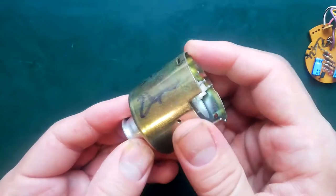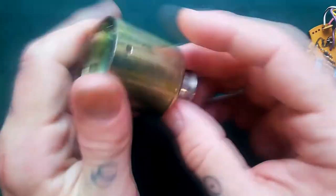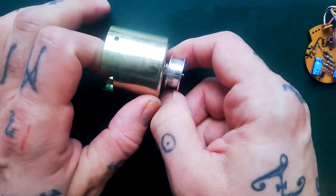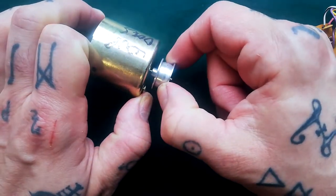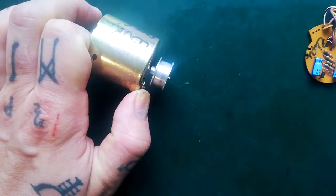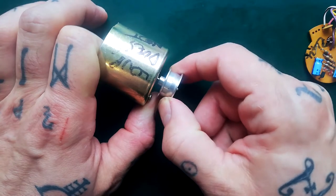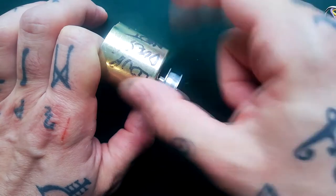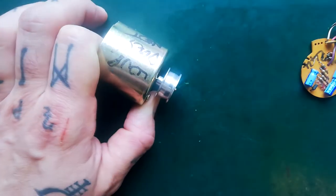So what you've got is actually a motor within a motor. I've never actually got as far as opening one of these up. Usually the pulley on these is held on really, really tight. I believe I would have to get some sort of metal clamp and a heat gun and really heat that up in order to release the adhesive that's inside there. I've seen a YouTuber do something similar where they removed the pulley from a reel-to-reel motor - they had to get a heat gun, put it on there for two minutes with the motor held in a metal clamp, and then pry it off with a screwdriver.